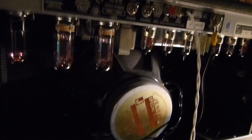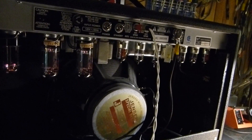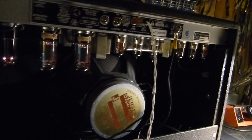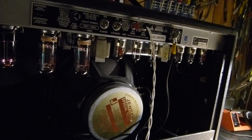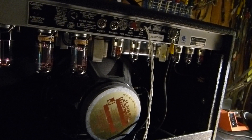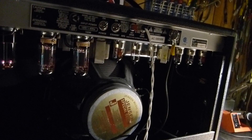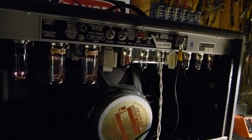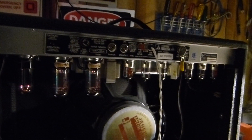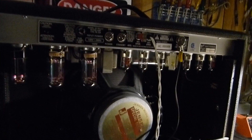And so is its power. You can change tubes for a thousand years and you're never going to fix this one. What I'm going to have to do is simply pull the chassis out, tighten up the pins, and clean them — it's a mechanical problem. You can change tubes until the cows come home and you'll never fix this amp until you sit down and figure out what the real problem is. Hope this helps.